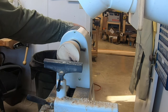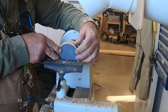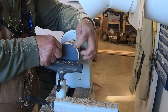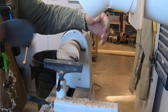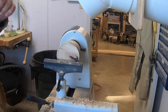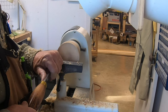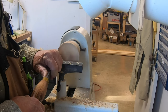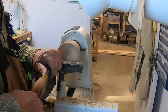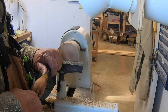I check where I'm at with the piece of slate — still got a little more to take off. I'm just going to sneak up on this so I get a good fit. Right there, that's it. I just need to go a little bit deeper for the glue lip. I want about an eighth of an inch of lip there so I can bead the glue and glue this thing in.